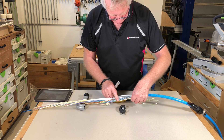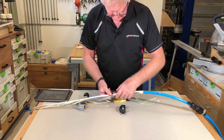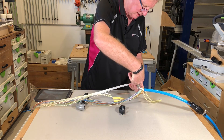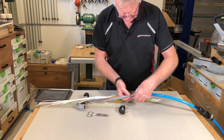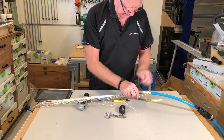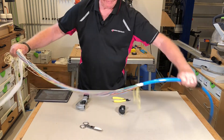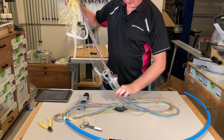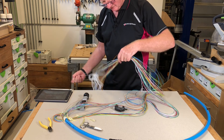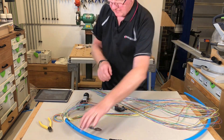There are lots of other yarns that we need to remove from the cable as well, because we don't want all of those in the gland. I've got all the Kevlar here. I'm going to cut the core wrap at the butt end and gradually pull out the water swelling yarns as well, as we need to get rid of those. Just be careful — these water swelling yarns can stick a bit to the modules. You don't want to tear the module when you remove these yarns, so just take it easy. Okay, I think I've got them all now.